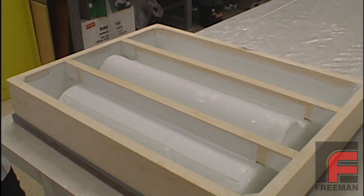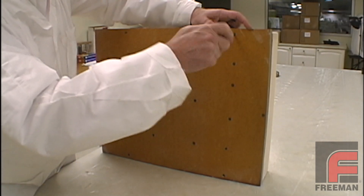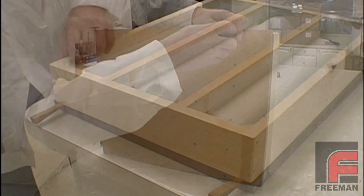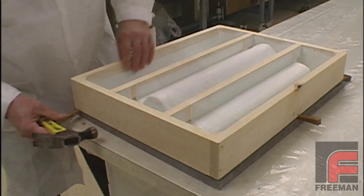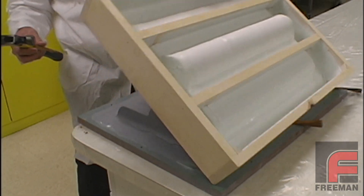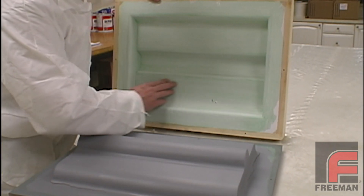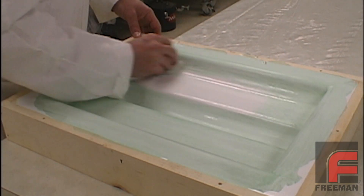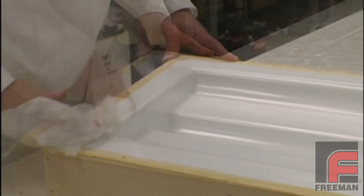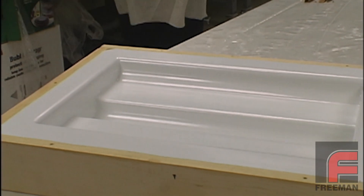Here is our completed mold, with the bracing completed. The next day, we remove the mold frame, and then use our wedges to slowly remove the mold from our model. Because of the careful application of mold releases, demolding is not difficult. Here we can clearly see the green color of the PVA mold release, which we remove with several damp cloths and then allow to dry. The mold is now ready for use in creating fiberglass parts, kevlar parts, or carbon fiber parts, as we will demonstrate in the next video.